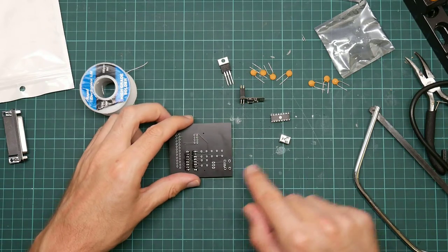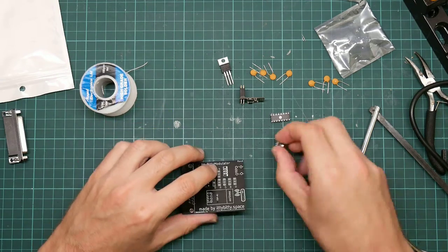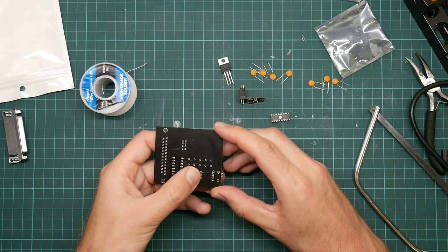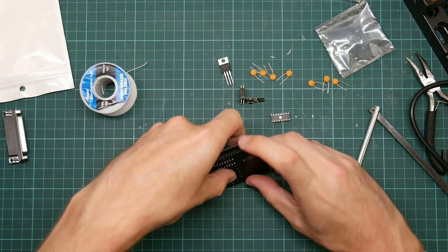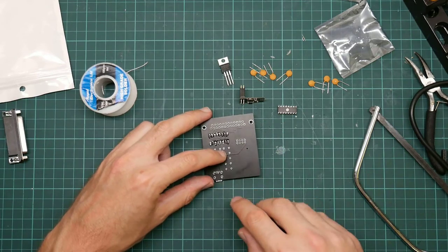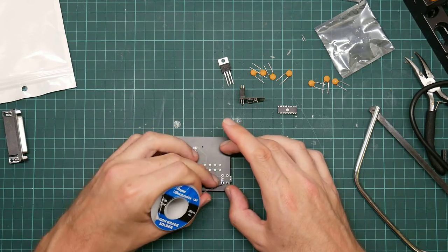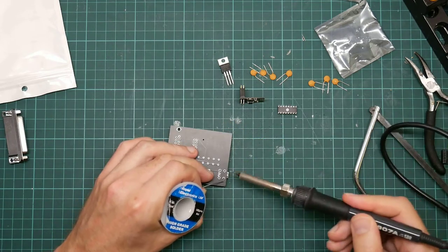And on this side, there is only one pin connected up, which is this one, which is power. This is only used to power the device because the serial port does not contain power itself. So I think I am going to make my job a little easier and only solder that one pin. The four big mount points for the shield actually hold the socket in place. So I'm going to use that to hold it down and not bother with the rest of the data pins.